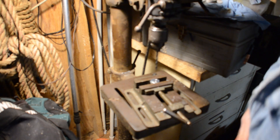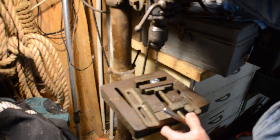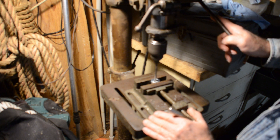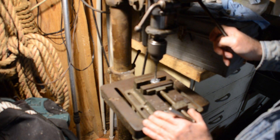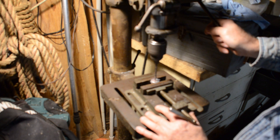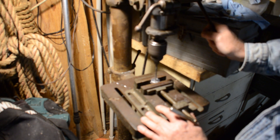Okay, I'm at my drill press. I'm going to start with a number 6 drill bit for the quarter-twenty, and I'm going to drill all the way through. Let the drill bit find that prick punch mark and take your time. I'm going to add just a little oil. Raise up on the spindle every once in a while to help break the shavings.